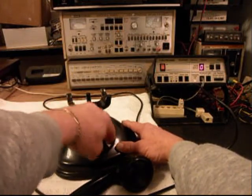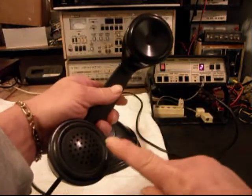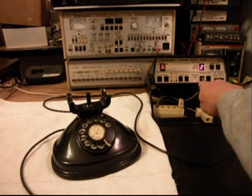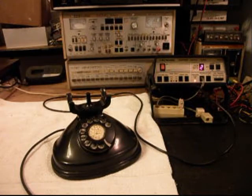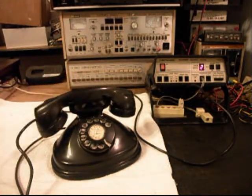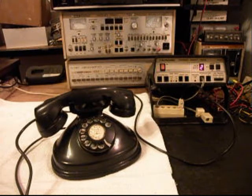I'm going to end in a two. Now what we want to do is transmit into the handset. So if you watch this red light on the analyzer, every time you see that red light, that's an indication of 100% modulation on transmit. One, two, three, four, five, six. One, two, three, four, five, six. Hello, hello. So we know that this telephone has transmit, receive, it's dialing out, and it's ringing. Now what we can do is go ahead and move the telephone over to a regular line, and we'll call the time and temp number.